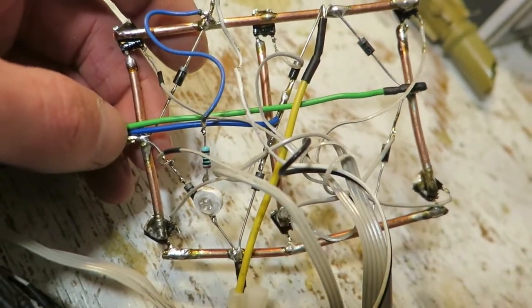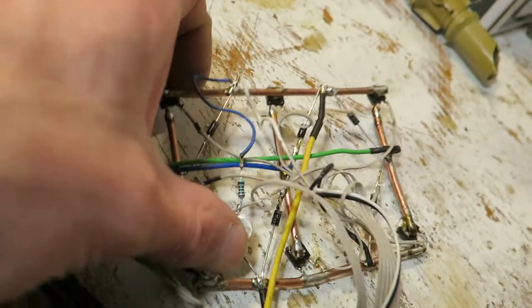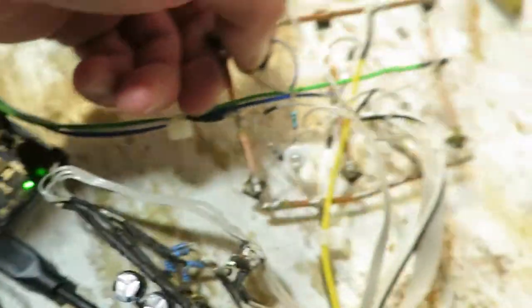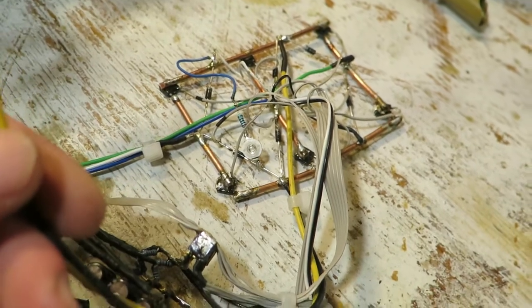Can I call this method nothing board? I will replace this soon, but don't expect anything fancy. I mean, breadboards are fiddly and not very reliable. And it's too early for PCB. Anyway, there's nothing more basically than MOSFETs and diodes for the protection. I am using 1N4008. It's nothing special, but as they say, any diode is better than the MOSFET internal diode.